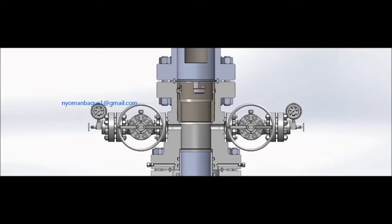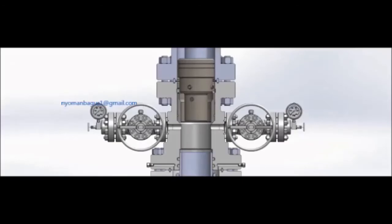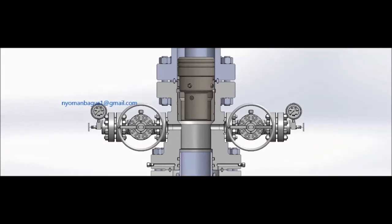After finishing drilling, it is time for retrieving the wear bushing. Orientate the combination tool with the lift pin screw at the bottom and lower it through the BOP stack until it lands on top of the wear bushing. Slack off weight from the combination tool and rotate it clockwise. The combination tool will drop when the lift pin screws have aligned with the J-slots in the wear bushing. Rotate approximately one-eighth turn clockwise maximum until a positive stop to ensure the lift pin screws are engaged into the J-slots of the wear bushing. Retrieve the wear bushing slowly with a vertical pull, then clean and store the combination tool and wear bushing aside.